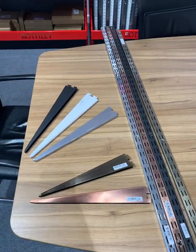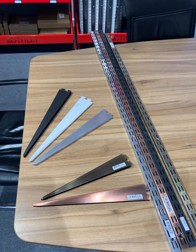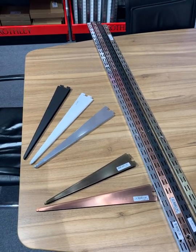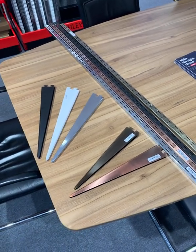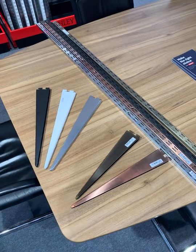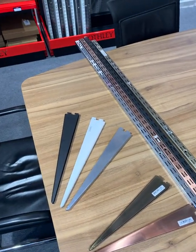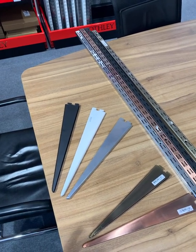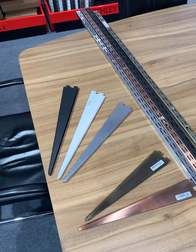We actually have our systems tested under British Standard. You can't actually test the product itself under British Standard — you have to do it as part of a system test. The only test available on twin slot is actually a wardrobe test, and that's defined by how the product is fixed to the wall, the spacing of the brackets, the spacing of the uprights, etc. You can't really advise people on what weight the shelves will hold, mainly because depending on the material of the shelf, such as a melamine board, it really determines what weight it will hold. We could say our brackets will hold 150 kilograms until they bend or break, but the maximum test under British Standard is 50 kilograms, and your weak points will always be the fixing to the wall, the type of wall, or the shelf itself. Bending the material is the last thing that will happen. So we say they'll hold up to 50 kilograms as a system.